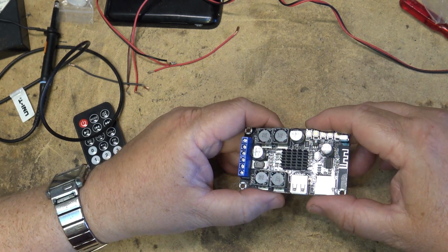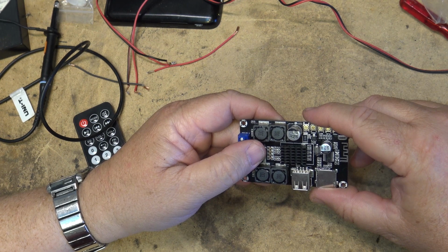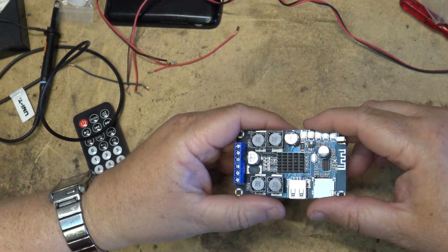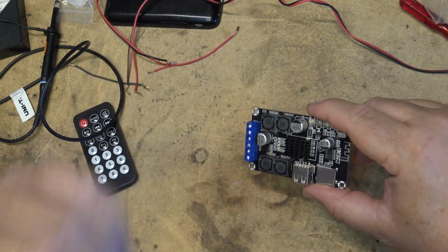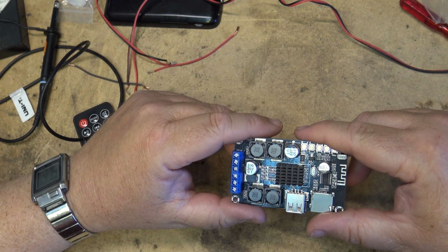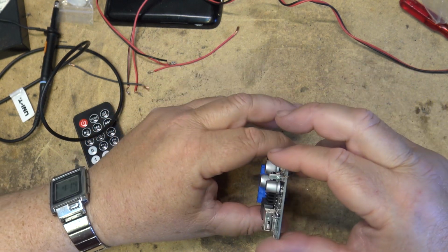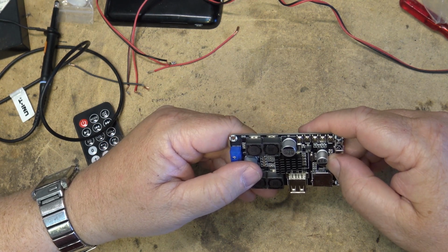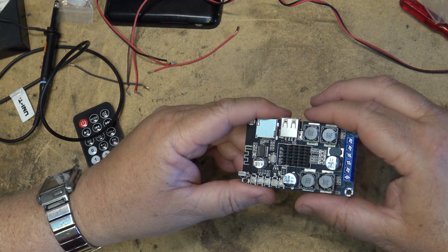And there are some very high-end audio companies out there, like PS Audio for one, which charges a small fortune for their amplifiers, and they're all using Class D these days for their output. They're using a MOSFET preamp to warm up the sound, and the really high-end ones are actually using a couple of vacuum tubes, a couple of little triodes, one in each channel, to take away some of the sterility of these amps, because these Class D amps now have a very sterile sound. They don't really add much to it. They don't add any color, and they don't take anything away. You basically get pretty darn close to what you're putting into them.